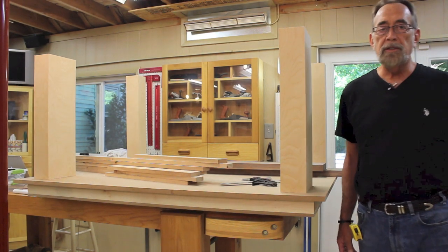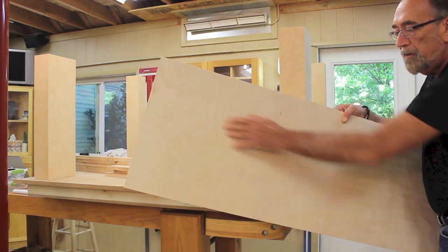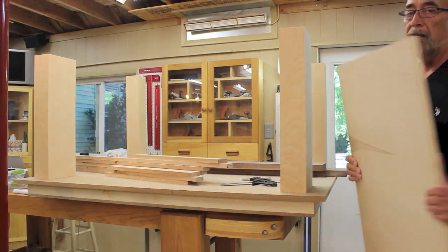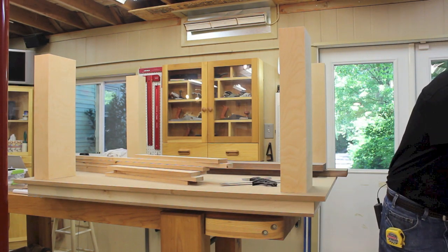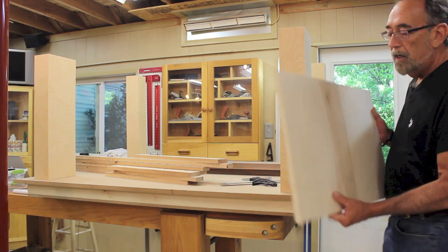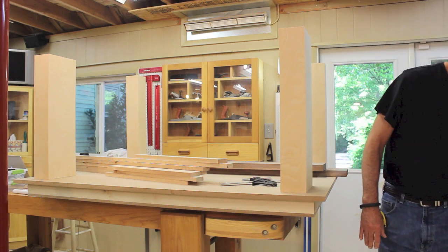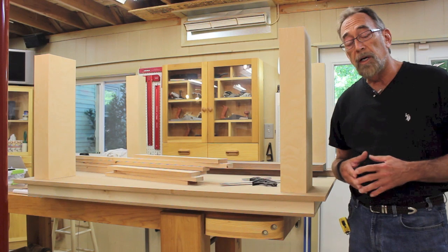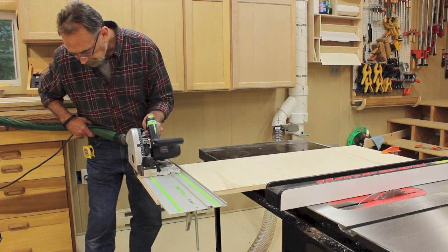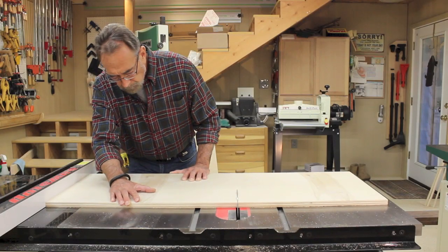With those dimensions in mind, I was able to cut the plywood panels to size. I made them an extra half-inch long so that I could set them into quarter-inch dados. This panel is 47 and 3/4 inches long, and the two side panels are 26 and 1/2 inches long. The height of all three panels is 17 and 3/4 inches. I've tried to use the SawStop for everything on this project, but my SawStop has the 36-inch fence, so to cut the large panel I used my Festool and guide rail system, and for the other two panels I cut those on the table saw.